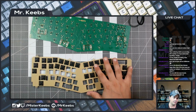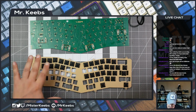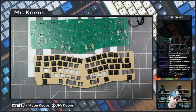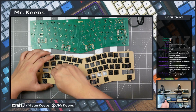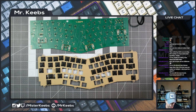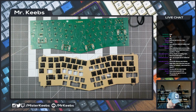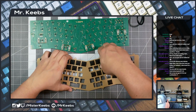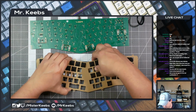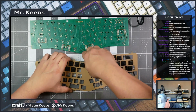And just FYI, if you watch the way that Anthony builds his keyboards, I always try to follow that. The reason I'm not doing this is because we actually soldered this board yesterday with different switches. And some of them were not all the way into the plate, and it was very, very hard to get them to be pushed all the way. And the reason I desoldered this today and lubed other switches is because I didn't like the way it sounded with the vintage blacks that I used. I think the vintage blacks that I got were not really good quality vintage blacks. So we're rebuilding it today.